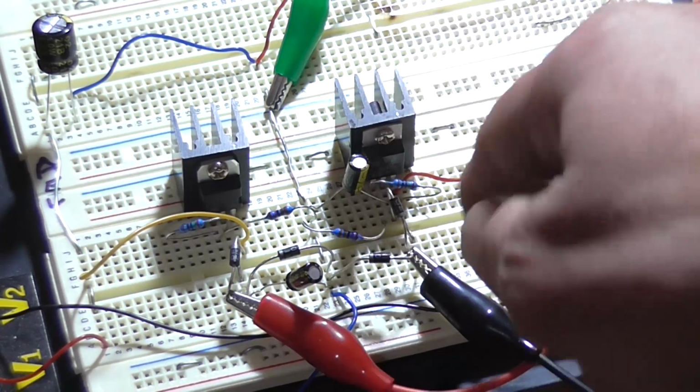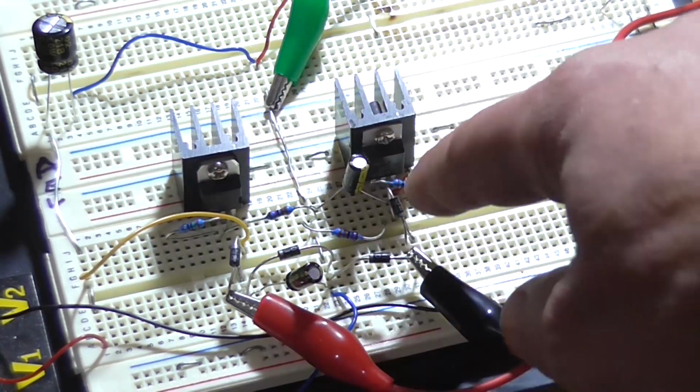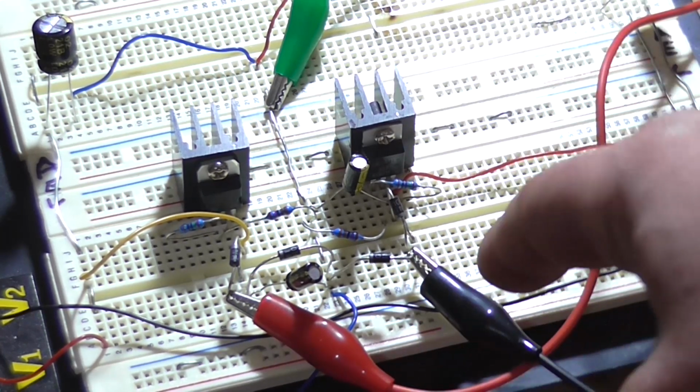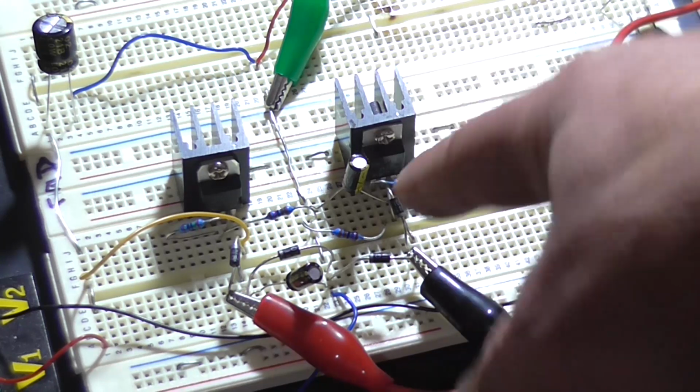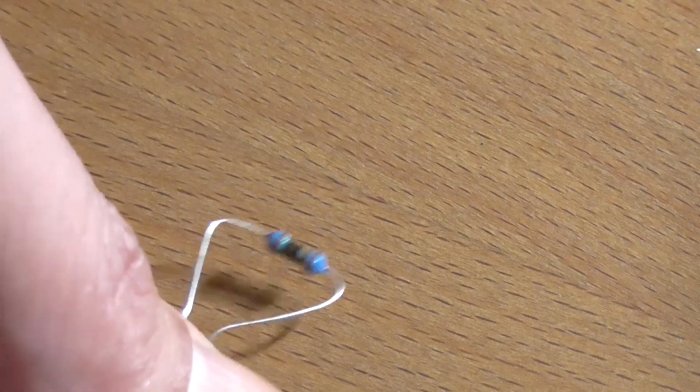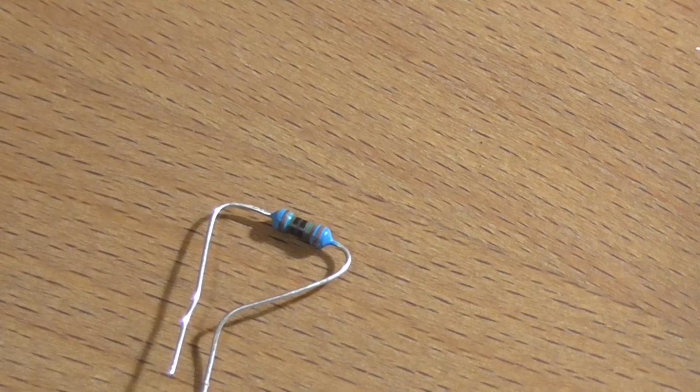So these are backwards. So I had it configured the same way as this side, and I was getting like 18 volts coming out of it on my DC bench supply, which is the maximum voltage the supply goes to. I'm like, what's going on here? And so I played around with some resistor values. I changed the 240 ohm to a 120 ohm, and I could smell resistors cooking, and it actually started destroying this resistor. So yeah, it didn't destroy the IC though.